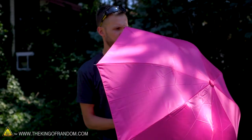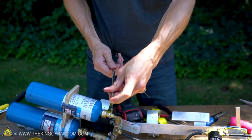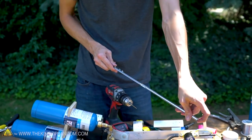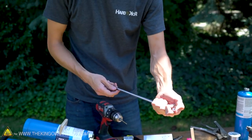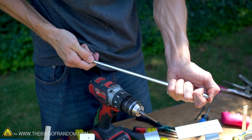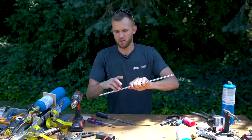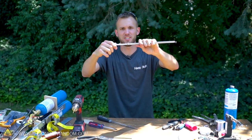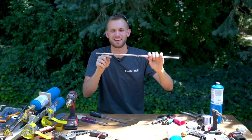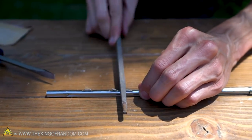I think I need to completely destroy this umbrella. The umbrella mechanism is pretty simple: we've got one metal rod that fits closely inside of another one. There's a lock that doesn't move until you press down on that — it collapses down. We do have these little barbs down here, but they don't latch onto anything at the moment. So what I need to do is cut a hole in the metal right here so that it'll hook onto those. That way when I push this button, it should spring out. We've got the hole filed in, so now we can bring this back and it latches into place. When we push this button down it shoots forward. This spike is a little more intense than we need it to be, so we're going to use the file to shorten it so we don't have to push quite so hard on this button.